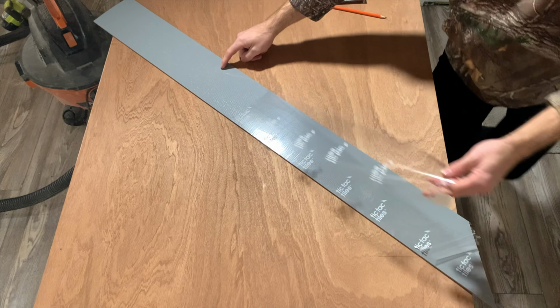And I wanted to leave a bit of overhang, but anywhere that it was excessive, I just trimmed it off. Now with the initial chevron pattern complete, I need to cut another 45 degree angle, which is gonna be the boards that match up with the 45 associated with the chevron. Just like before, I made the cut with a utility knife and a carpenter square, but if you're using actual lumber like a 1x4, you'll have to use a miter saw. And then you would just attach it to this solid core door using construction adhesive and brad nails.